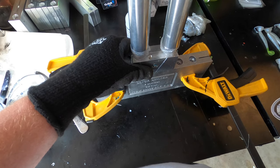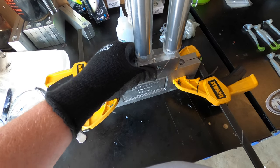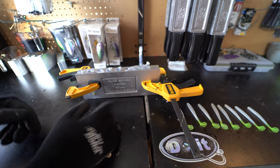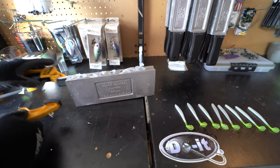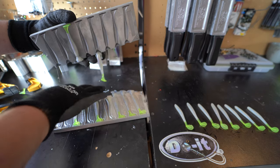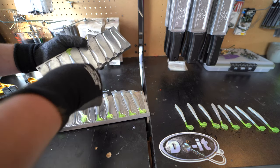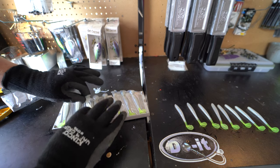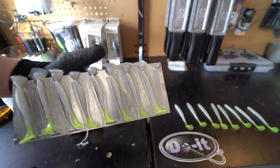The plastic is starting to get a little stiff, but we're going for all eight cavities at once this time. Sucking up as much plastisol as I can, confirming good flow, coming over to the mold with even pressure. Just got to keep going one at a time, topping off as needed. Let's get these clamps off and see how this batch turned out.